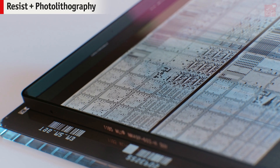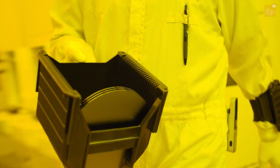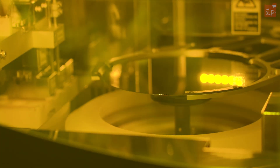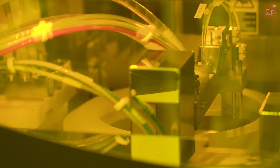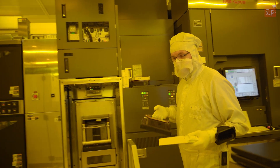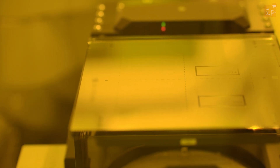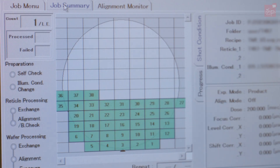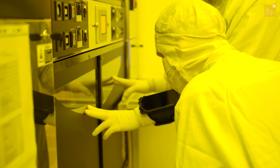To create a pattern, the method of photolithography is used. An optical mask is irradiated with UV light to transfer the geometric design to a photosensitive resist. The first step is to spin-coat the resist onto a wafer. This coating technique involves placing a small amount of resist on a substrate; the wafer starts to spin, which spreads the liquid resist over the entire surface creating a uniform film. The resist-coated wafer and the mask containing the design structures are then loaded into the lithography machine. Once they are aligned, light passes through the mask and the lens system projects the mask four times smaller onto the resist. Only one die at a time is exposed to the light, so the whole wafer is fabricated die by die.